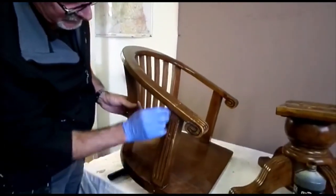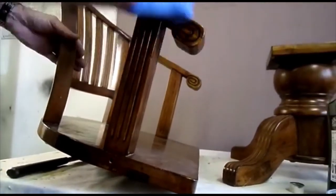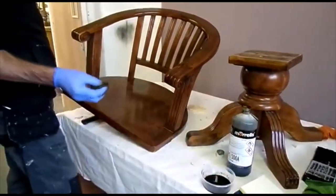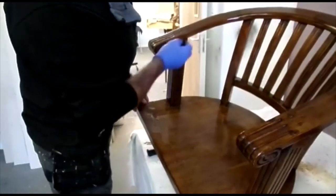We're not restoring the full surface — stripping down the full chair and recoating it is not worth it, it's not financially viable. So I'm just using the stain to blend these areas in so they're not as noticeable, so they don't stand straight out in your face. This stuff won't come off your hands, so always wear gloves. It's solvent-based, so you need to be in a relatively large, ventilated area when using it, and if you're putting a lot on or working with it over a longer period, you really need to be wearing some kind of mask.